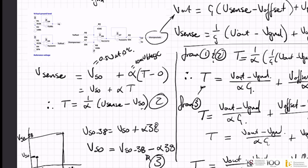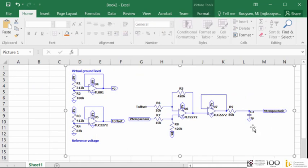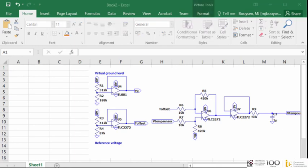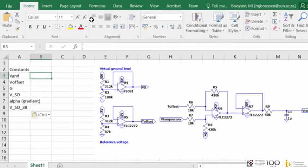This is the analytical solution; we have to get the empirical solution — what it actually is. So we have to calculate the calibrating constants and calibrate the whole circuit. The way we'll go about this is to insert a temperature, measure the response at the output, and use that to calibrate our circuit so we can apply a formula in software to calculate the actual temperature. The first thing to do is put the constants into our spreadsheet. I like to use Excel for these types of things.